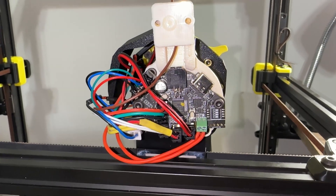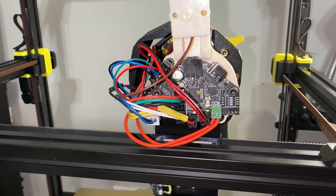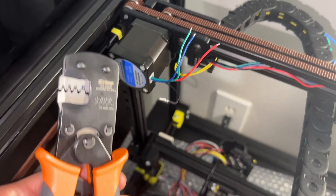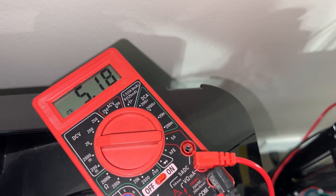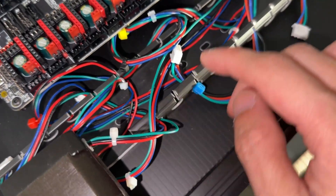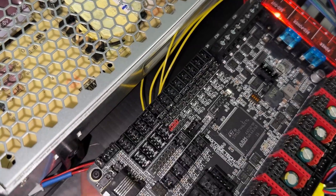I have a few more steps for CAN bus — that's why I opted not to finish all the wiring yet. This is so I can flash the CAN bus firmware on both this board and the Octopus. There is also a reset button that requires dismounting the board. There have been some reports of these boards turning on the heaters during first startup, so if you don't have it connected, it's not a problem. And that's it for this video. I went through a somewhat high level of wiring — there are videos that explain basic electrical in better detail, and I highly suggest watching those if this seems over your head. A multimeter really is your best friend. We have reached 10 videos and the build is pretty much done in terms of assembly. In the next video, I will flash the CAN firmware to both boards and tidy up loose ends before the first startup.